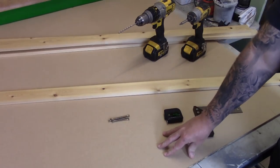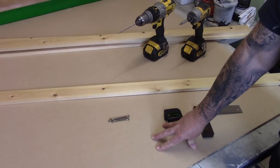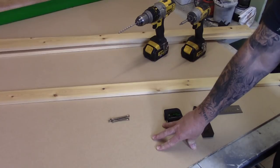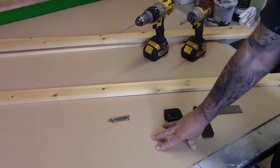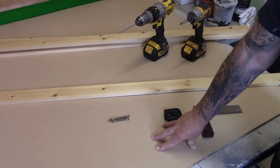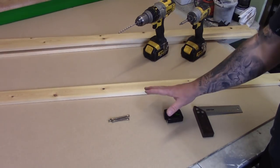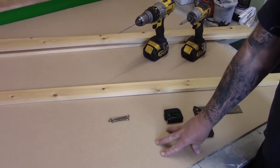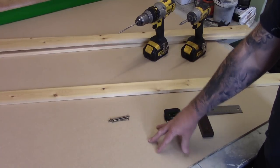Just to give you an example: there were a couple of boards I'd done with this exact same technique for last year's Scouring of Cheshire. I had no storage space for a couple of them and they've been in my back garden, covered by a tarp for nearly 12 months. One did get slightly wet in the corner and it slightly warped the MDF, but we're talking 4 or 5mm — totally not noticeable. So I know for a fact that 9mm is sufficient.